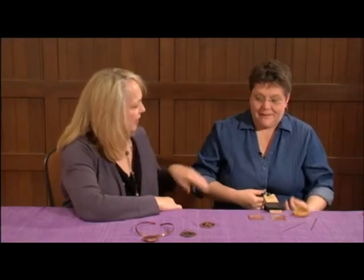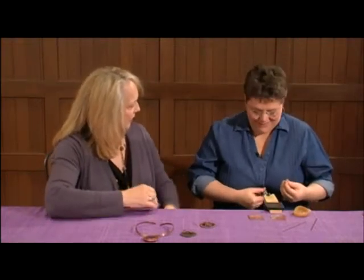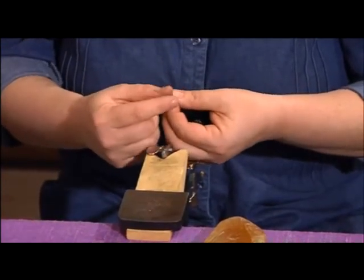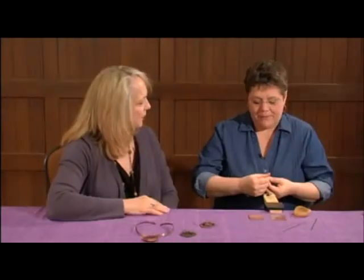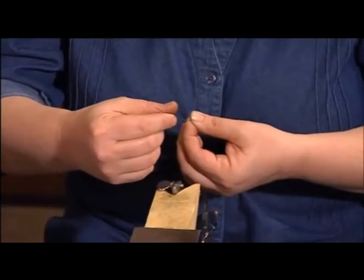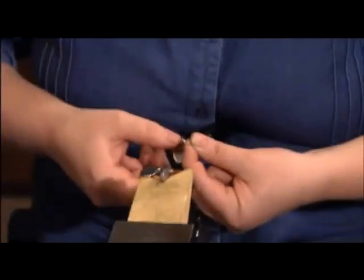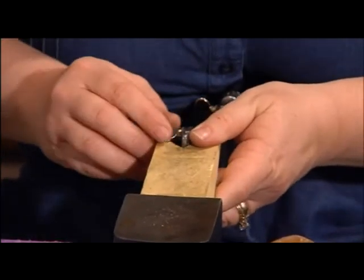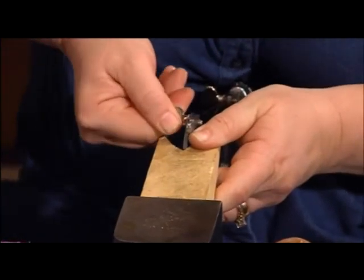Let's get started with the sawing. I see that you kind of wear your saw - I keep a bruise right there. The hardest part is getting your saw blade in the right direction. It's a thin strip of metal with teeth on one side and no teeth on the other. When you run your finger across the teeth - because they're so small you can't really see them - you run your finger away from you and you feel the teeth. If you could see them they would look like a little Christmas tree. You lock in one end, then push into the table with the belly part - that sets my frame in a bind, which gives it the right tension.